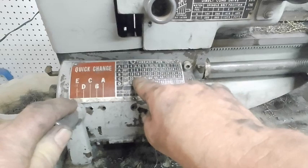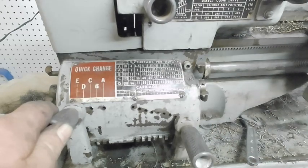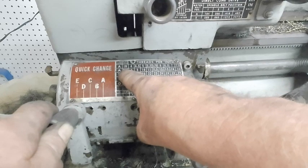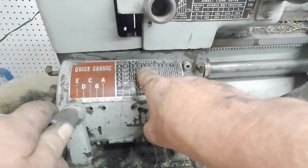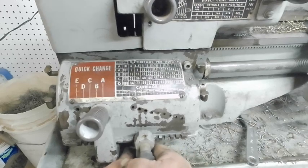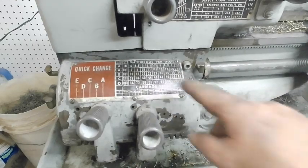To demonstrate what I was talking about with the change in threads per inch: I'm going to set this machine up — this piece won't matter, we're just going to do a simple pass to show you. I'm going to set this up to be 10 threads per inch because my back gear is already out. We're going to set it on 10 threads per inch and the actual output will be 20 threads per inch. So I need to set it to A, move to A, and bring this lever to position 3. So now our feed is set up to 10 threads per inch.